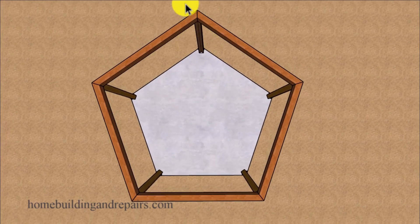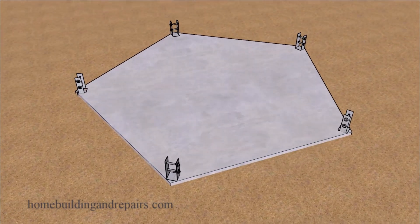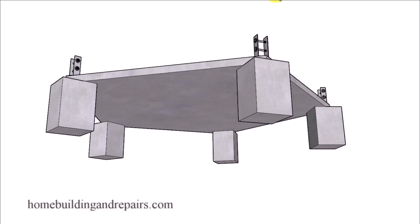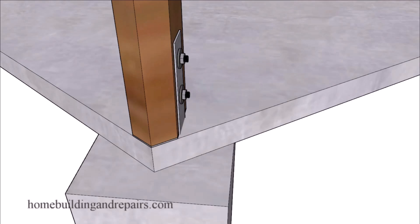I did shape one of the posts and will provide more insight about that when we start putting everything back together. When we remove the soil we have five footings and some post base connecting hardware, along with our shaped connector. I don't know if you need to use a four by six base connector and then cut it, because I don't think we're going to be dealing with that much structural weight on this particular project. But if you're building something larger you might want to give it more thought as to whether you'll need a larger post base connector.